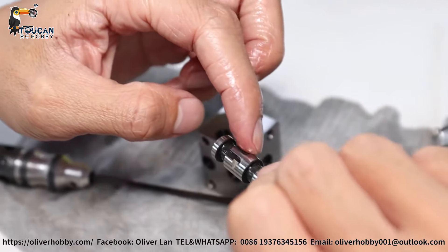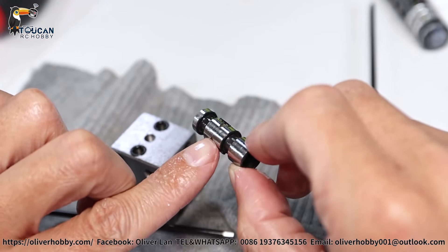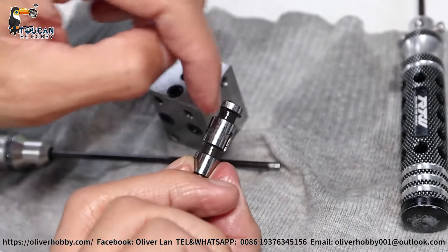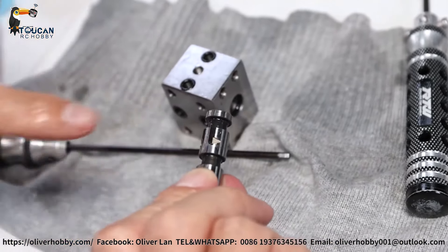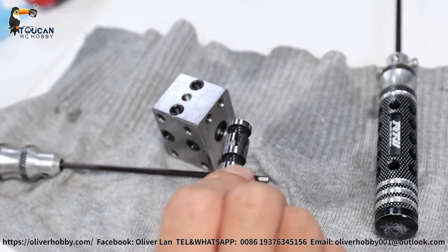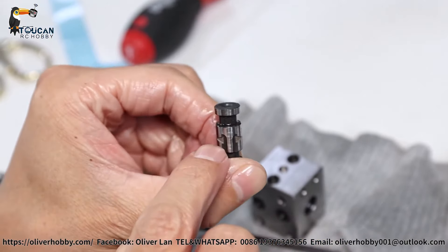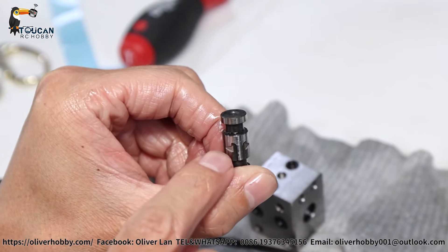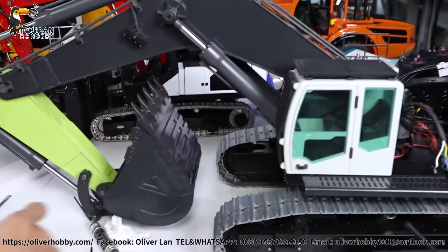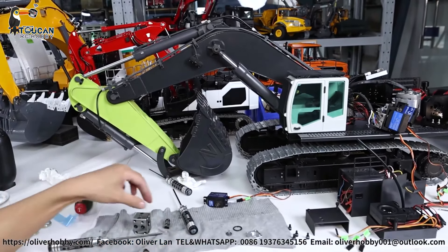You will see this side corresponding vertically — 180 degrees corresponds to open and closed for inlet and return line. That's the V-shape design: slowly opens the oil inlet and also the return line via the V-shape. That's how you control it. The oil goes to the cylinder, slowly speeding up. You can control with even a cheap radio — the speed, you can slowly increase. That's the smart design of the V-shape.